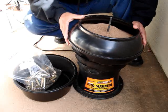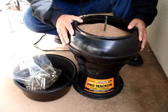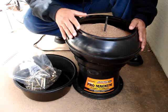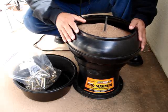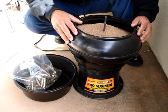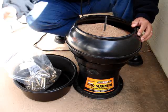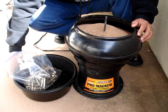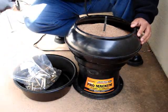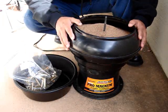I've loaded this tumbler so full it's been cocked to the left, cocked to the right, and it just keeps going. I've left it on for two or three days, totally forgot about it, and it keeps on going. It doesn't make too much noise. If you want to reduce the noise, remember basic house construction — if you're in a garage, you're good to go. If you're in a house, find an area of the floor where there's a beam going across and make sure it sits on the beam itself. That's going to reduce the noise a lot.